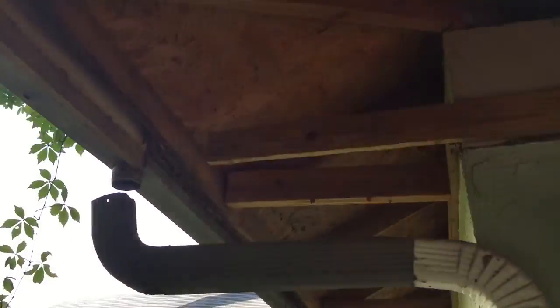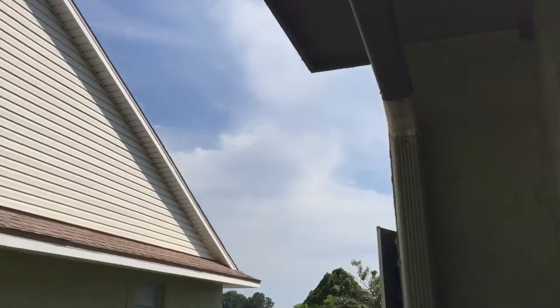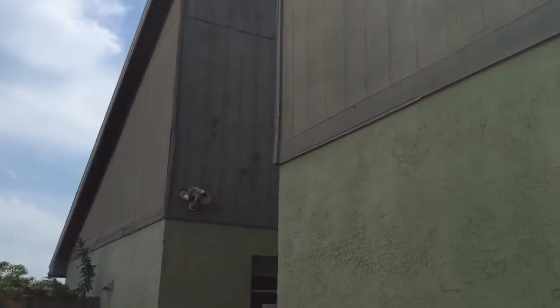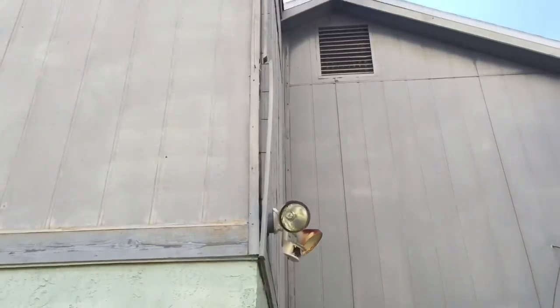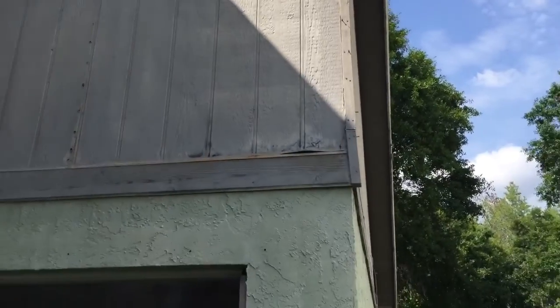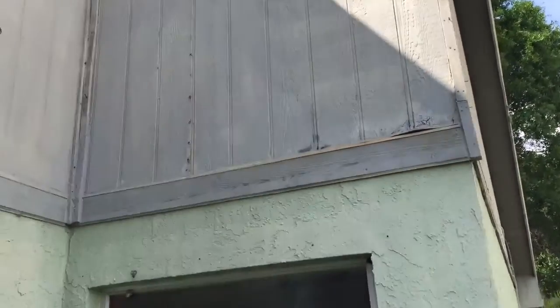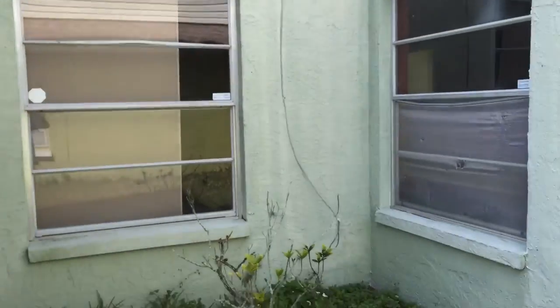This side here I've got a fixed gutter and there's more rotted wood all the way from here through here. We save whatever we can to minimize on the labor and material, but there's a point where we have to decide what needs to go. So here we have to repair those — whatever rotted wood we're going to cut out. Right there we need a whole sheet removed and installed because you can see that rot right there.